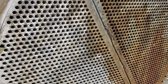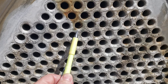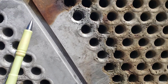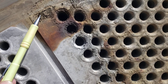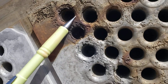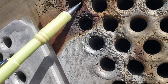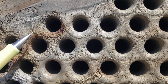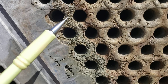These are three-quarter inch tubes and they're welded in place, welded to the tube sheet, which is not unique. But what I wanted to show you is the corrosion attacking the weld metal buildup. This is a weld overlay tube sheet with welded tubes. Notice that some of the welds are completely corroded away, where the preferential attacking corrosion has attacked the welds attaching the tubes to the tube sheet.